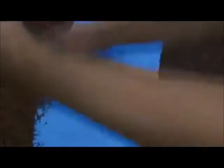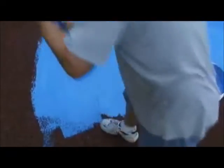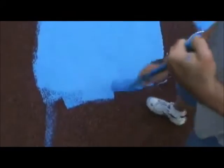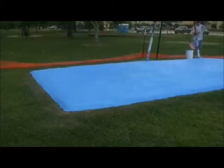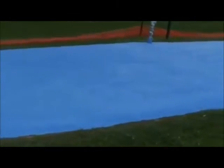Playground Pavement Top Coat fills the voids and creates a solid rubber layer that is not porous, so it is important that the surface is properly graded for drainage. Most EPDM surfaces are installed at a proper drainage grade, but if the existing surface has drainage problems, you should consult with a U.S. Pour-in-Place advisor before applying Playground Pavement Top Coat. And if the existing surface was improperly installed over drains, you should not use our product on such a defective design.